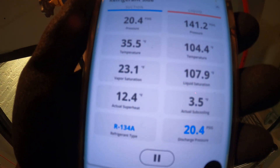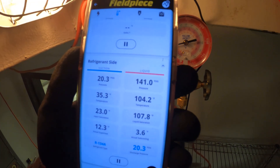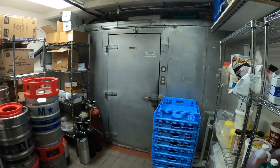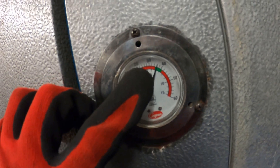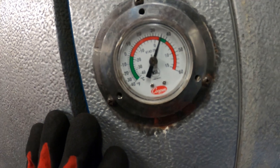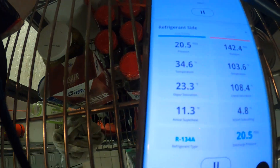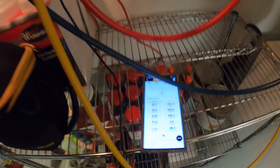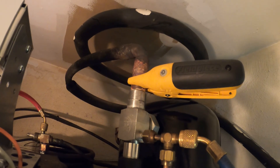It's looking pretty good. We have about a 12-degree superheat and the subcooling is low. Superheat looks good; subcooling is a bit low, but I've got a 35-degree suction line and this box is going to come down in no time. We are just at about 35 degrees in here — you want this to cycle between 35 and 40 degrees, and this is looking great. That condenser water is very cold from the cooling tower, but with that adjustment this should do fine: 11.3 superheat, 4.8 subcooling. Subcooling is a bit low but it makes sense — got good temperatures, got decent pressures. These tools are a lifesaver.